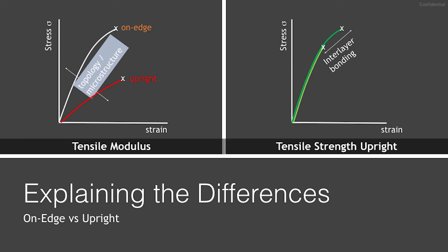Focusing on the graph to the left, the differences observed in on-edge versus upright specimens are explained by two phenomena. The first is that the fiber orientation in the on-edge specimens is much greater since the filament layers are in direct alignment with the pulled direction, while upright specimens are being pulled perpendicular to the direction of the filament layers. Any microvoids present between layers could also provide an area of weakness, especially in the upright specimens since the stress is being directly applied to the area between layers. Regarding the graph on the right, the change in stress values of the upright specimens as extrusion width changed is related to the amount of energy involved to fuse the layers together — wider beads correspond to a higher level of energy, resulting in better bonding and thus higher stress values.